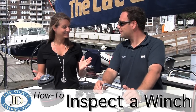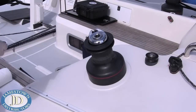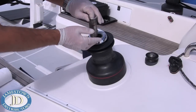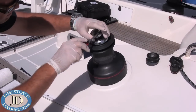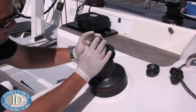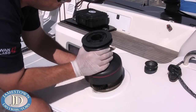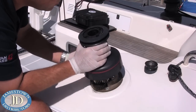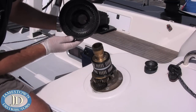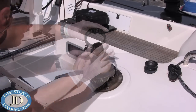Let's get started. Begin by removing the center screw or cap. Remove the stripper arm, noting its location on the winch. Slowly remove the winch drum. Check for any inner bearings that might be sticking to the inside of the drum — proceed with caution as they like to drop out into the water unexpectedly. Disassemble the winch onto paper towels to keep the deck clean from grease and oil.